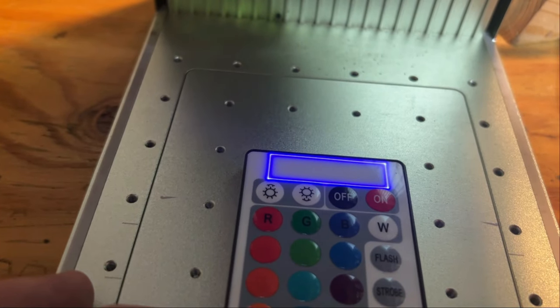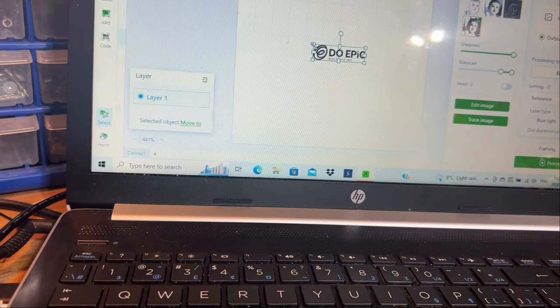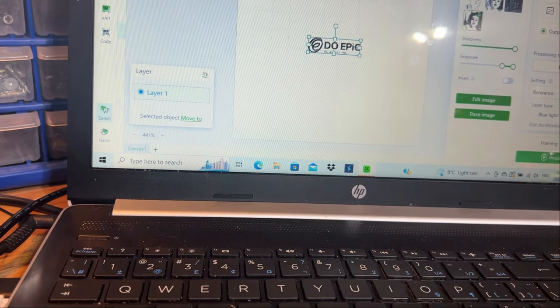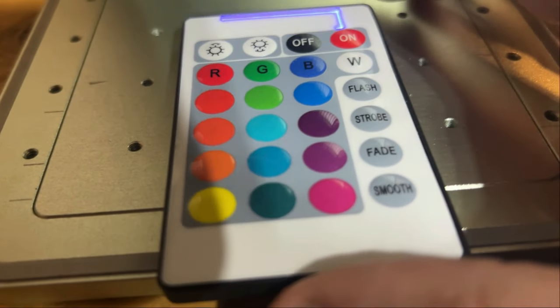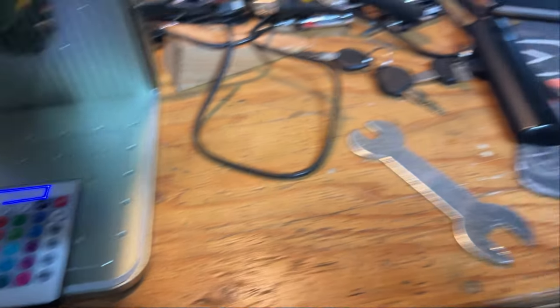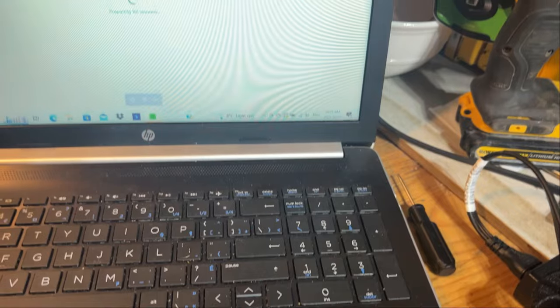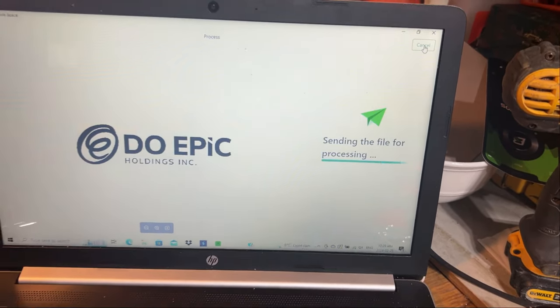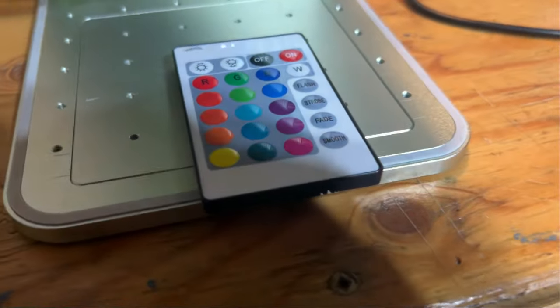What the framing button does is it shows the area that it's going to imprint, so it gives you time to line it up however you want. That's kind of big, so I'm going to make it actually smaller. I'm going to line it up with the crosshairs and hit framing again. You can see how it's smaller now. So I'm going to line that up - if I wanted to go to the side, I'm probably going to be right there. I'm going to turn off framing, hit process, and then hit start, which now starts the printing.